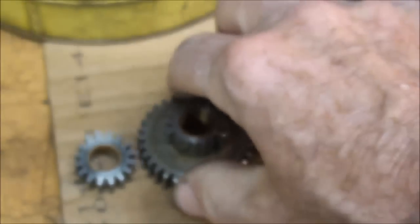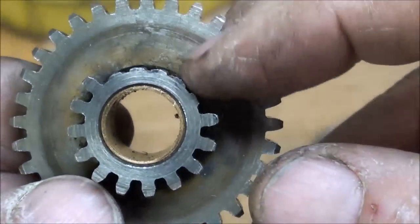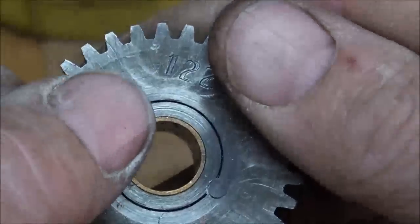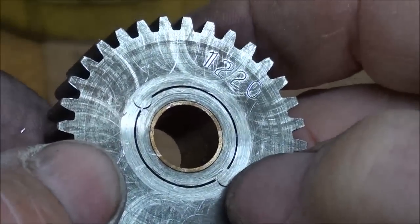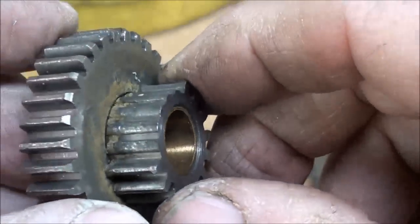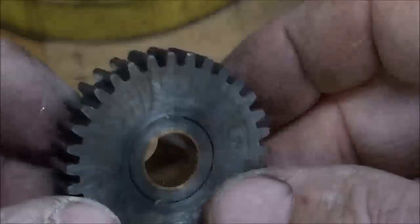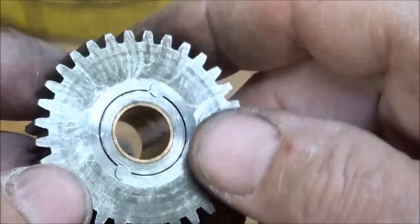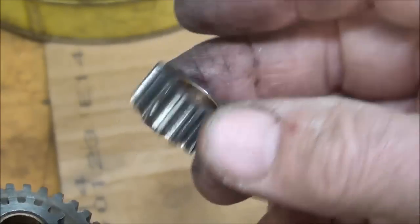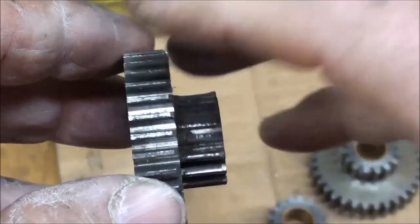There are some people who have heard the term 'stripped gears' — well, that's a good example. Smaller gears tend to strip a little bit easier. These gears are pressed together and then drilled and pinned. That gear wouldn't be all that hard to make if I had the right cutters. I'm going to go into eBay and then into the Boston Gear catalog to see what I can find. That's probably not a stock gear because of this extension that presses into the big gear.